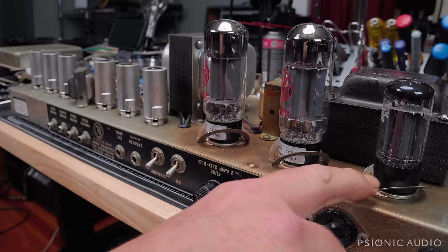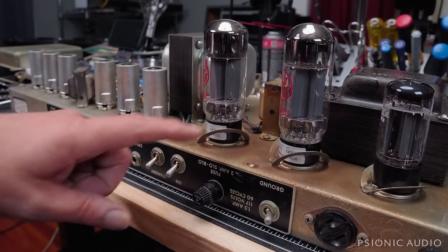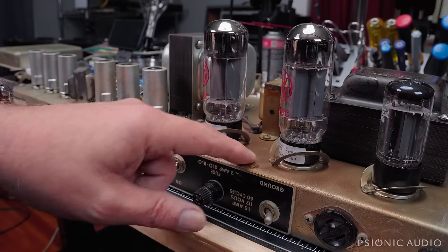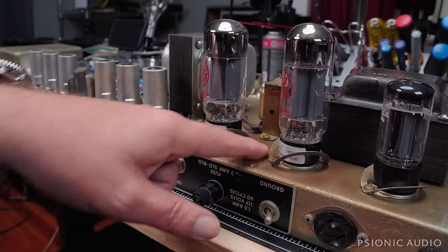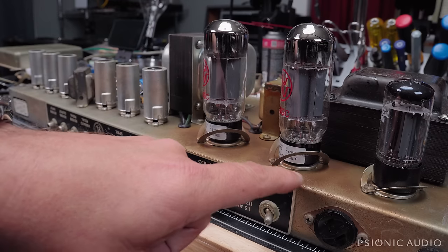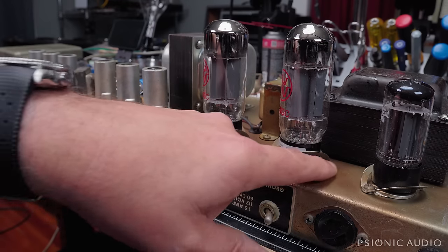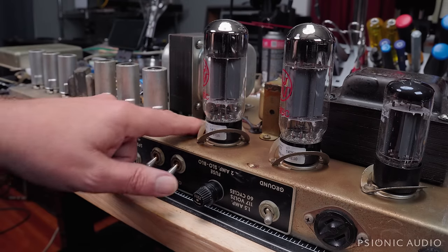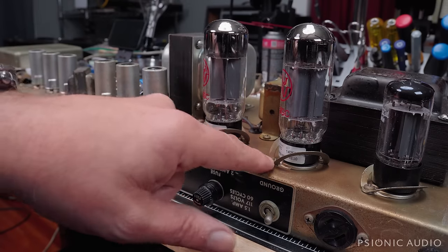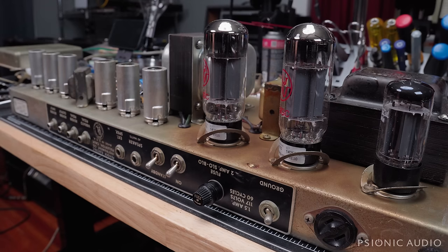It's alright if there's a patina in general, but a patina doesn't have to involve dirt and gunk and decades of someone else's cigarette smoke. Especially where grounds are made and chassis connections are made, you really want that to be as clean as possible. This amp has the original bear trap retainers, not the spring retainers they went to later. You can see discoloration from heat around the tubes, and the plating is beginning to want a little bit of rust. The WD-40 treatment on the entire chassis will take care of that — removing what's there and impregnating the pores to prevent the rust from spreading. The least aggressive technique that works is the correct technique.